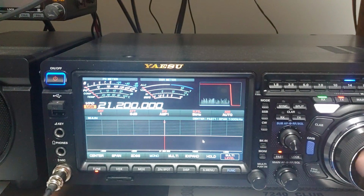On the 15 meter bands, on the extra portion, you get 21.200 to 21.225, and 21.225 to 21.275 is your advanced portion, which most people don't use. There aren't that many. There are still a few advanced, but there's more extras now. No more generals and extras. And 21.275 to 21.450 is your general.